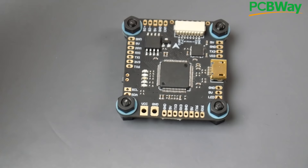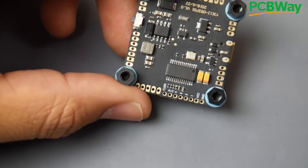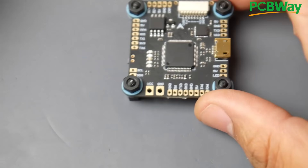If you wanted one megabyte or 16 megabytes of flash, we can grab the ICs and salvage them from old boards. Speaking of salvaging parts — the most important things to salvage from a flight controller are the microcontroller unit, the gyro, and the resonator. Those are the most expensive SMD components. Everything else you can basically purchase for 50 cents or less, which is really nice.